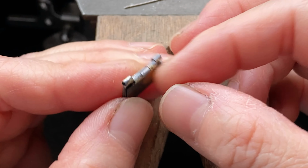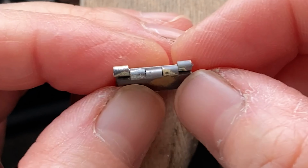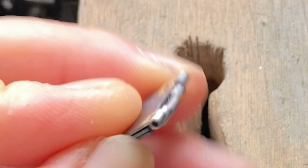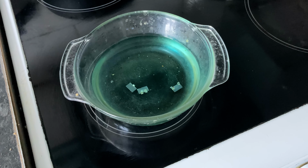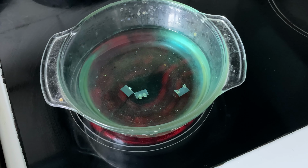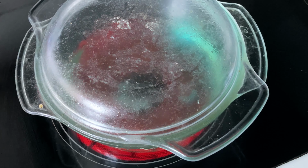Obviously, the tubes are not aligned at this point. I need to make some small adjustments so I can feed the silver wire through to hold them together. First, the flux residue on the surface needs to go. A warm pickle bath will get this sorted in 30 minutes.